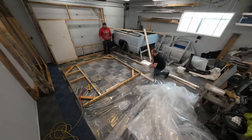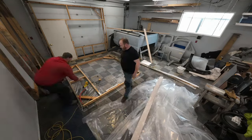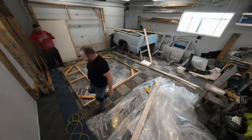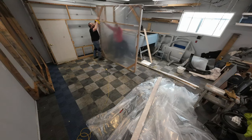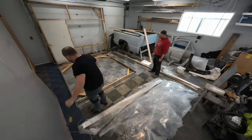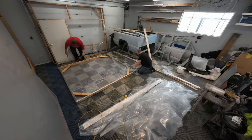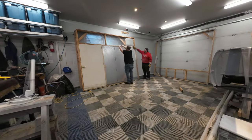Now we're laying down the new poly — this is a six-mil poly that is supposed to be UV-safe and is quite a bit more expensive. We're wrapping it and stapling it. I'm not being quite as diligent this time with the silicone; I felt it was airtight enough just with the staples. We wrap around and staple on the backside so it holds better and is more airtight. This is exactly how I did it last time, just without extra silicone — and the silicone from last time is still there acting like a gasket.